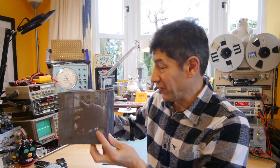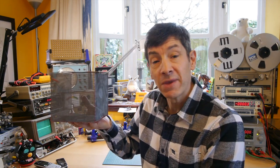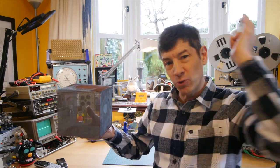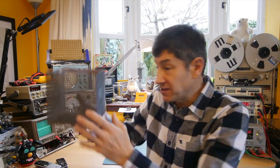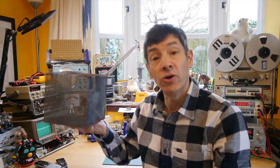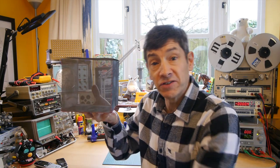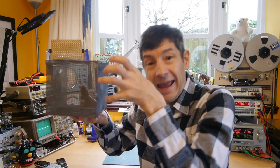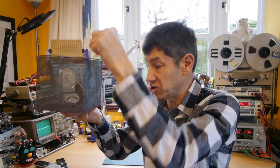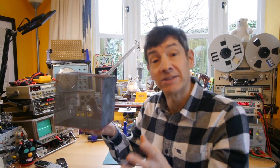So what are the uses of the Faraday cage? There are a whole range of them — some in everyday use and some in scientific laboratories. One you might have seen is the incredibly huge Van de Graaff generators with people sitting quite close to them on stools inside a cage. The sparks are hitting the cage but they are not getting electrocuted. That Faraday cage is connected to ground, so the surface of the cage is all at zero volts and cannot increase the voltage inside. The spark that flies from the Van de Graaff generator just goes straight through the cage and down to ground — granted, that's a sort of strike of lightning rather than a direct electromagnetic wave.